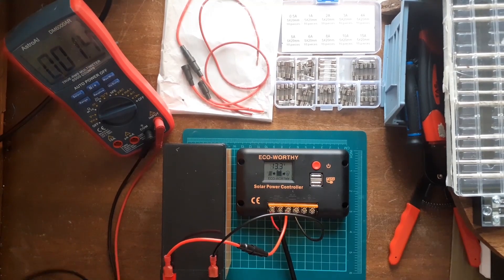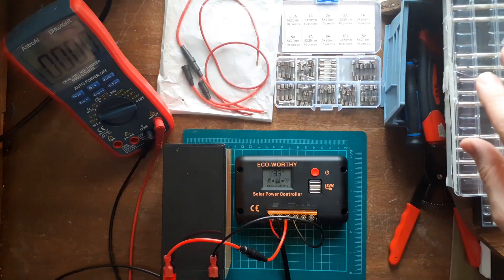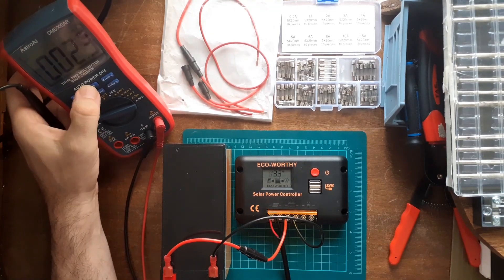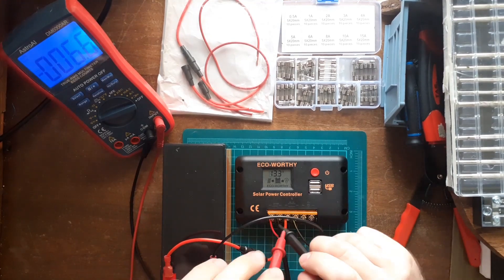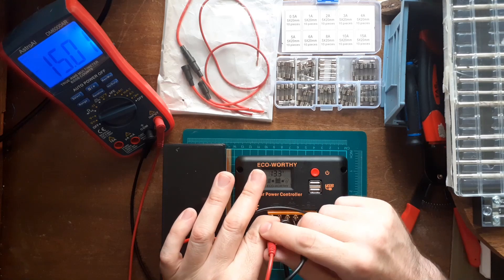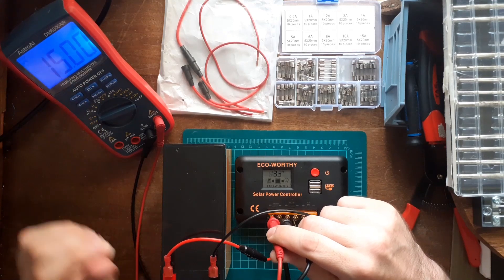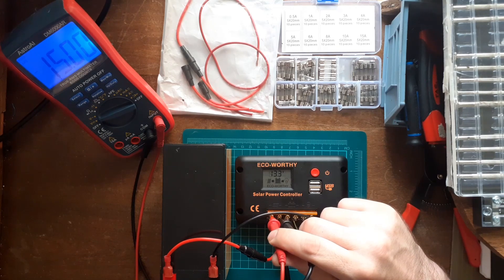Let's check how much voltage is coming in from the solar panel. The solar panel line goes out to a test panel I'm using for this project. On the multimeter, positive to positive and negative to negative — we're getting 15.1 volts coming in right now, as you can see on the multimeter screen. You'll see it fluctuate from time to time because the panel is just inside the window. This is where I do all my testing — it's not the same as in the field where you'd get full voltage.